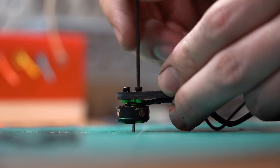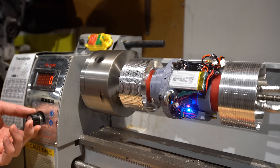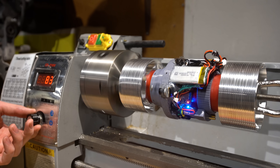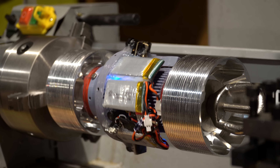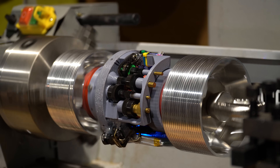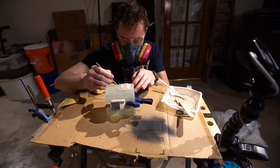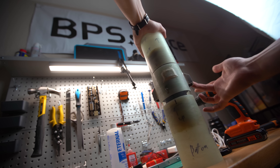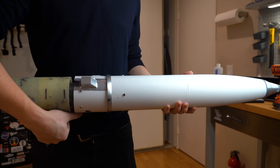One of the biggest problems here is that the brushless motor I selected can't rotate the assembly slower than about 40 degrees per second. So when this whole thing spins up, it does so with a really intense jump before we get spinning. It also means that if the vehicle is rotating slower than 40 degrees per second but not zero, we get jumpy and inconsistent motion. But this thing is a prototype, it's just a proof of concept — the most important thing is getting it to flight so that we can move on to version 2.